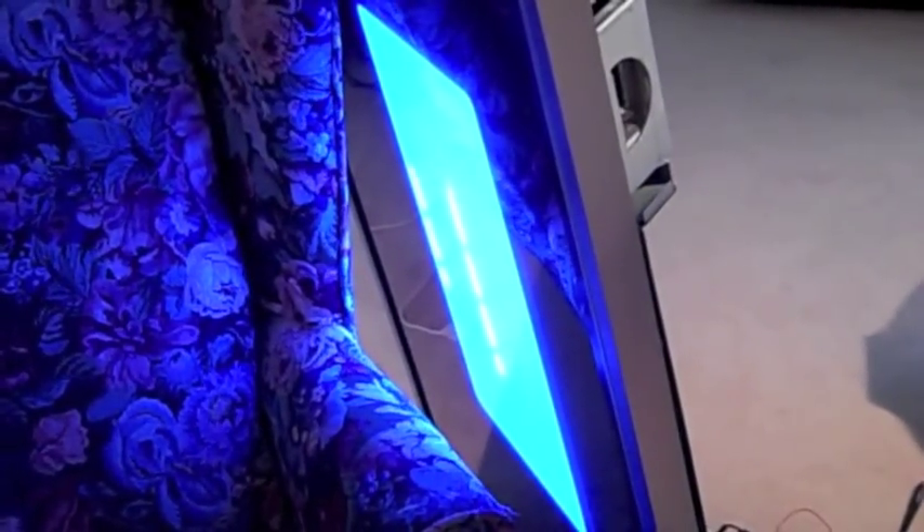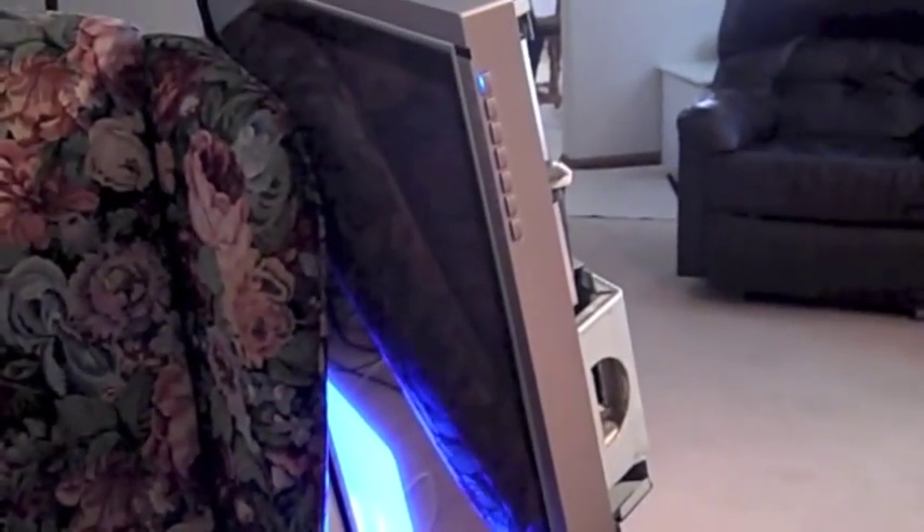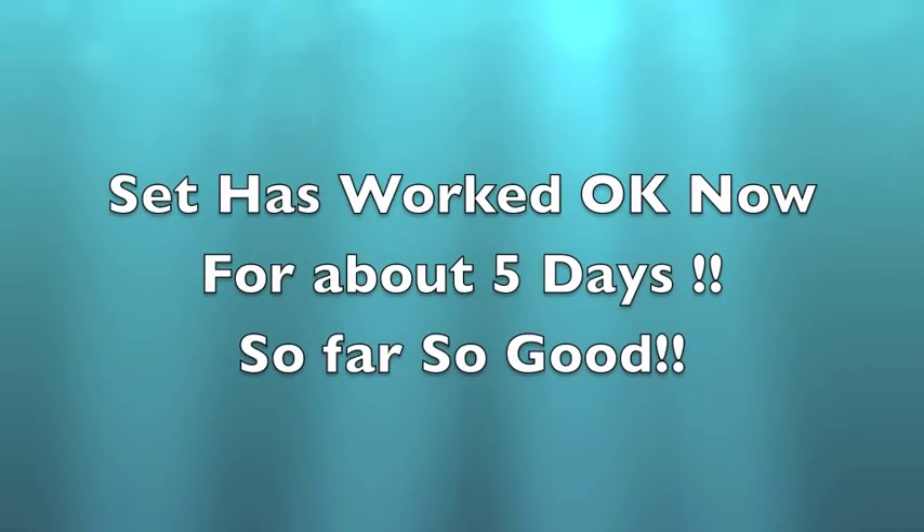You can tack them in there and it works just fine — no problem. So we're back in business. We had bad capacitors in the power supply — replaced three of those — and then these zener diodes were the next problem. I'm going to put a fan on the back of this set because these things run kind of hot. A small computer fan over the heat vents would probably extend the life a little bit. That's it for the Dell W5001C HD — we got it running!